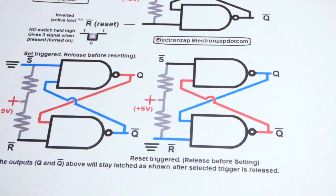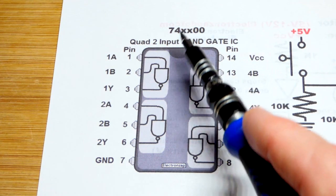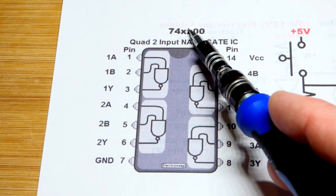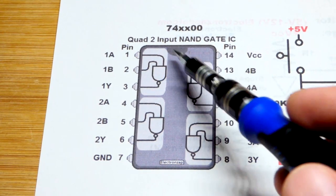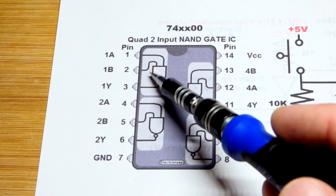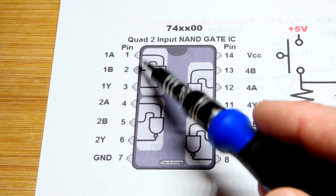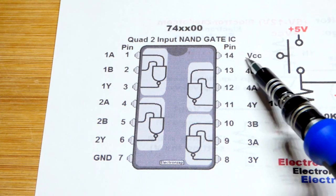Here's a sheet from another circuit I did, showing the pin layout for the 7400 integrated circuit. I'm actually using the 74HC — high-speed CMOS version — that's probably the best one to use. The 74HC00 is a quad — you can see there are four NAND gates, each one with two inputs. Want to pay close attention to that.